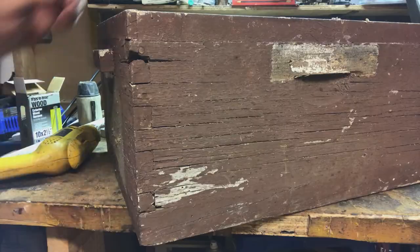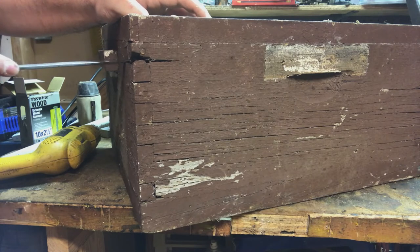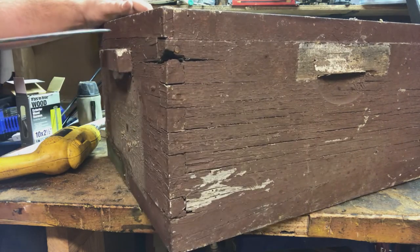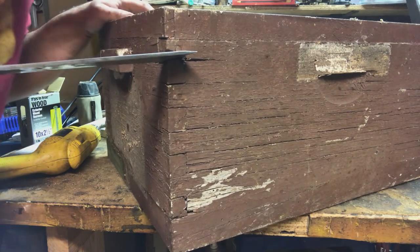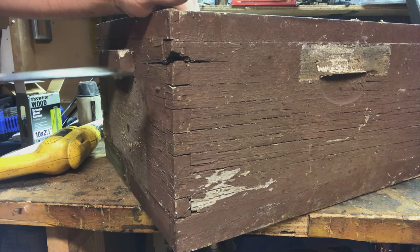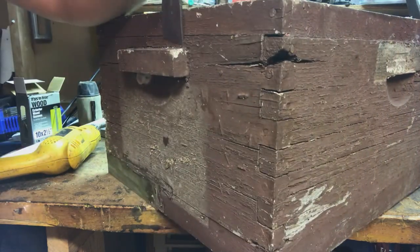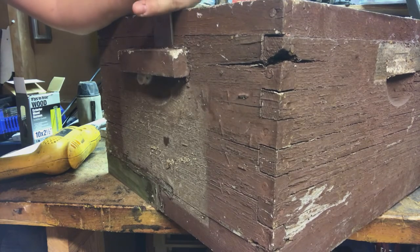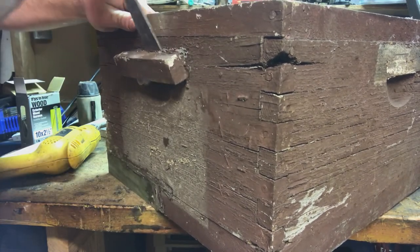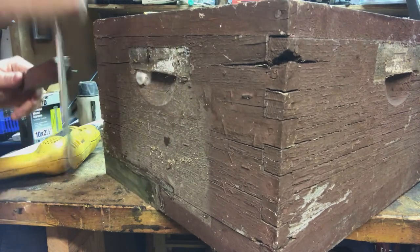So, here's another joint of concern. Like, doing the poke test, a little rot in. Especially right over here. Could patch it because it is above where the true handle is, but I personally feel that the other side isn't rotten. I'm just gonna seal this over with wood glue, maybe get wood filler. I'll chip some of the rot out and just pack it in there. It's on the side to where I'm more about mitigating rot instead of cutting it off there. Like when I patch, it's usually because it's along the bottom or the top. When it's in the sides, it's all about trying to cover it up and keep the rot from spreading.